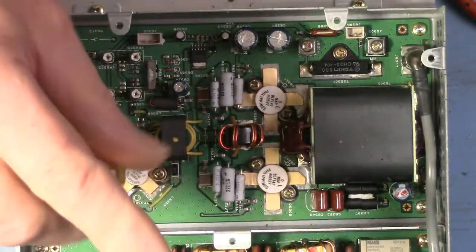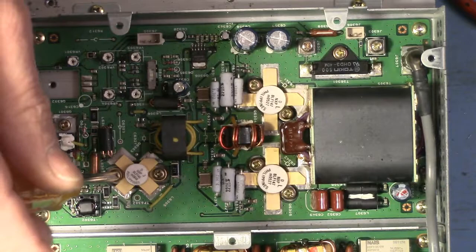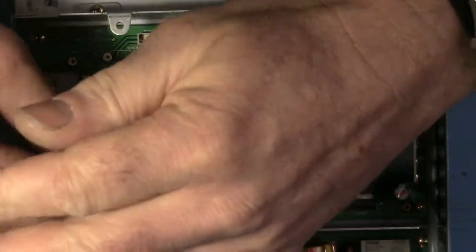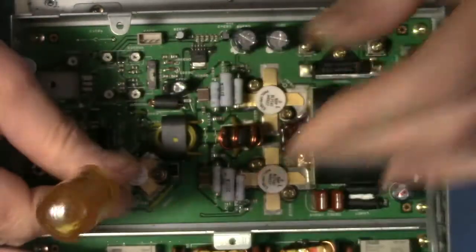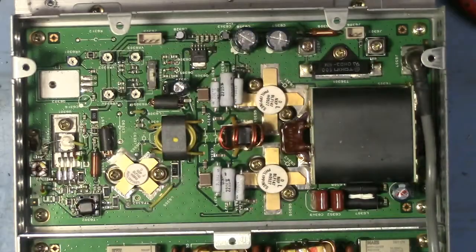I am reluctant to tighten screws, even steel screws, into aluminum. If they don't want to go, there's something wrong. I hate taking apart radios where people have cross-threaded or forced screws into holes simply because they'll go. It works. It works. No, not really.